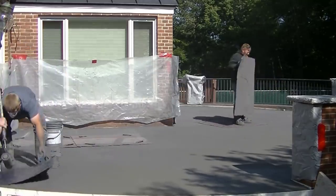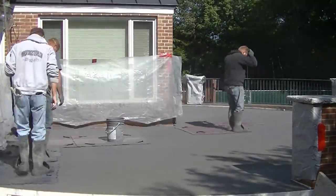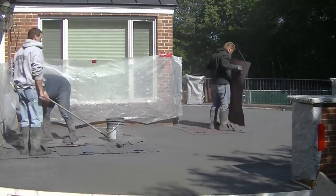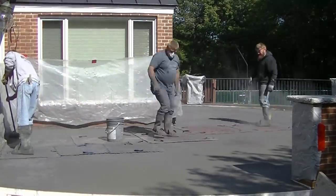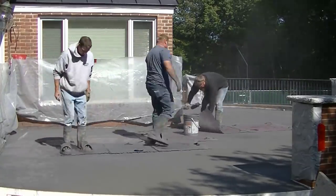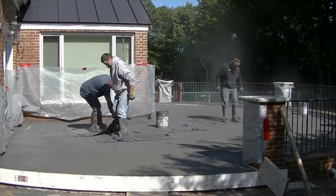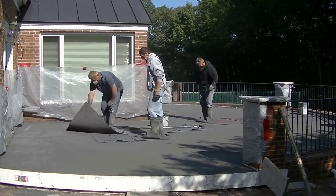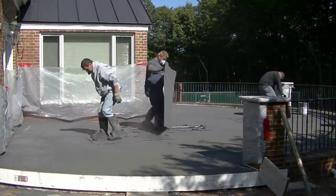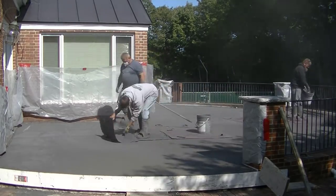I came back about a month after and shot a little walkthrough video — this is what you're going to see at the end of what it looks like. You can see the detail in the stamps really, really good. That charcoal release agent really leaves a nice antiquing effect on the concrete as far as color goes. The concrete also had integral color — we use what's called a gull gray. It just helps keep the concrete a little grayer than normal, because if you don't put color in concrete, when it cures out it turns kind of white. So in order to keep it a darker gray, you've got to actually add gray to it — you wouldn't think so, but you do.